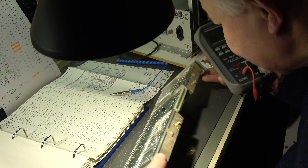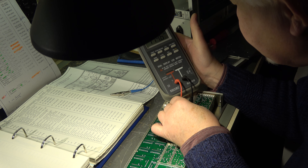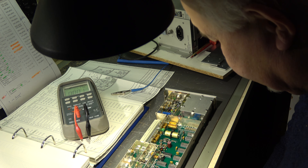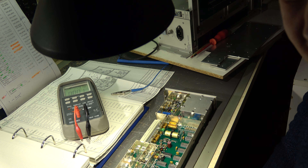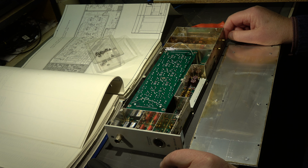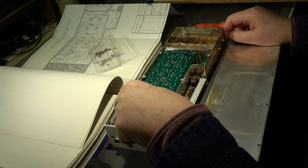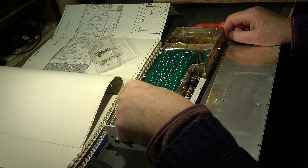Quality in this case is 1. Should have 22 microfarad, but it has a bad quality. This one should have 100 microfarad — reads 114 — and the quality is okay. I think all four electrolytics in this board are okay. No reason to swap them.